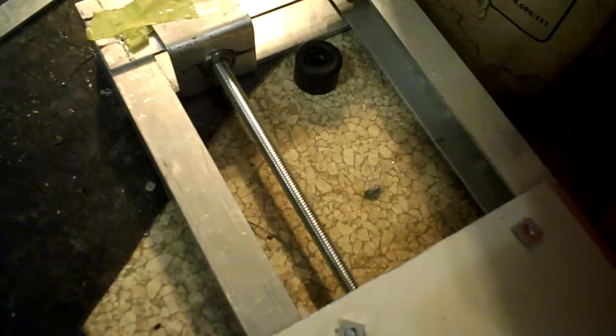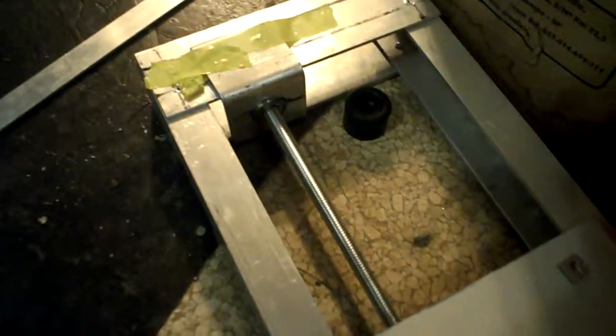We'll see how we go. I'm only going to put one rivet in this, because this isn't measured exactly — I wanted to leave enough room for this to maybe move left and right just a tiny bit. This bit up here will just get drilled twice into there.